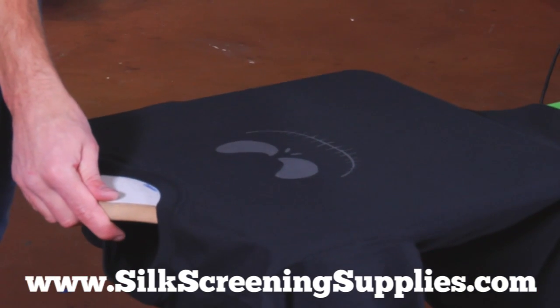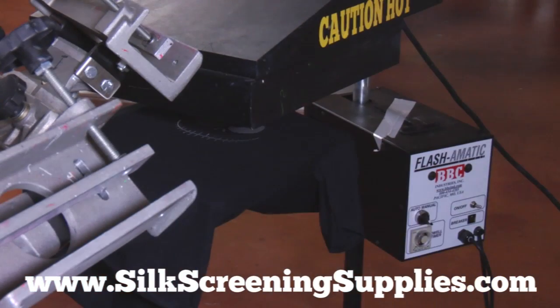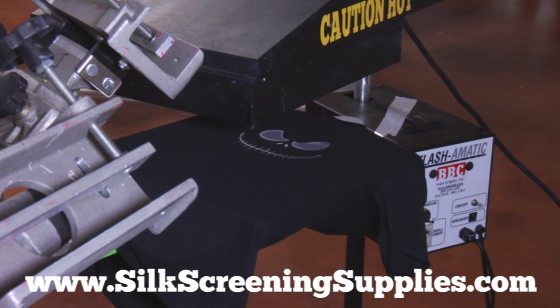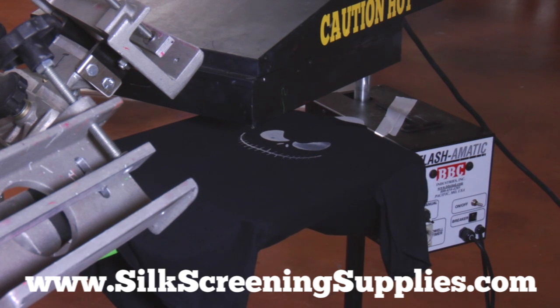So there's the RyoCharge without being cured. We'll run that underneath the flash dryer. We're using a forced air flash dryer to cure the ink, and you can actually see the discharge process happening right now. You can see that discharge effect starting to take place as the shirt's heating up. As it basically gets going, the wet look goes away — that's the discharge actually activating. It's leaving the shirt completely dyed out but nice and soft. The advantage to using a RyoCharge or discharge ink is that you don't have a hand or feel on the ink.